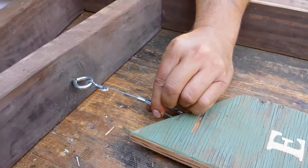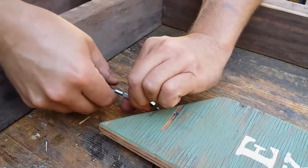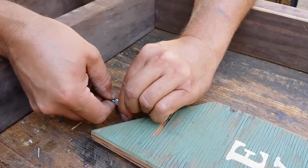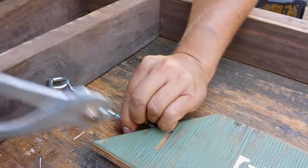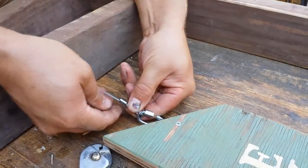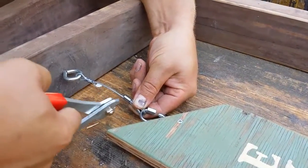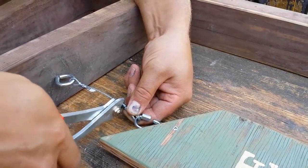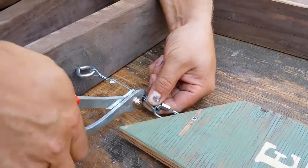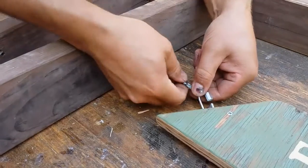You don't want that to slip off and hit someone. This stuff is actually kind of overkill for something like this because it's rated for like 400 or 500 pounds. We use eighth-inch for our grapevines, but safety first. Something like this, the eye bolt's gonna rip out before this cable ever breaks. Then you use this little crimper — I used to have a crimper for my hair back in the 80s — and you do a couple crimps on the sleeve.